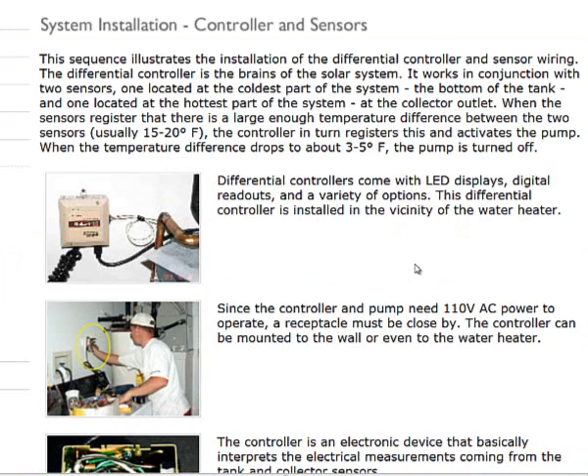A differential controller is an op amp that is monitoring two different voltages. Those two different voltages are being monitored by the difference of resistance in some thermocouplers — thermal resistors in most cases — or possibly some power-driven temperature sensors such as the LM34 or LM35 type of chip. They all come down to the simple fact that we're taking two different voltage readings and measuring the voltages as they relate to a temperature.